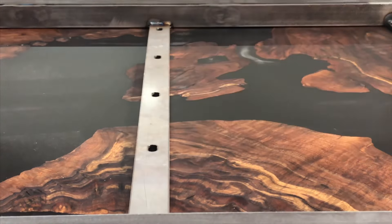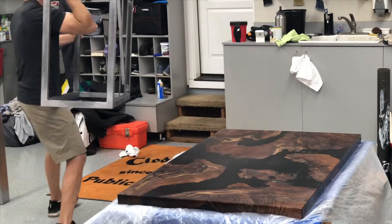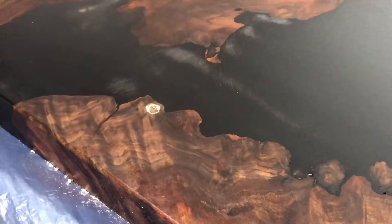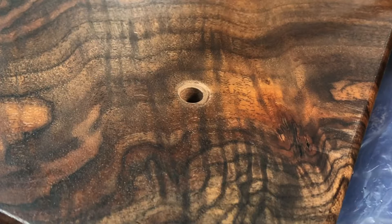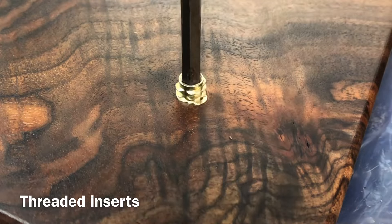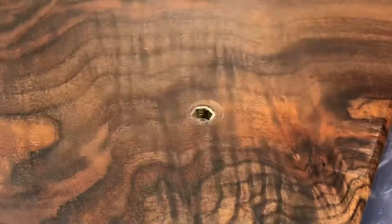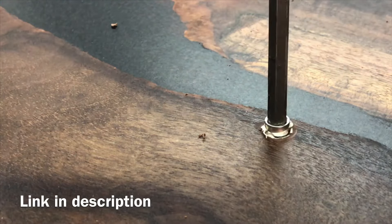What I'm doing here is lining up the holes to drill for the threaded inserts. I use these little zinc threaded inserts I get off Amazon — it's like $7 for 50 or 100 of them, really inexpensive. They go in a lot easier than you might think. My holes aren't perfectly vertical, but they always seem to line up exactly straight when I thread them in. I have a little dab of wood glue in there — not entirely necessary, but I do it a little bit for lubrication and to make sure they stay put.